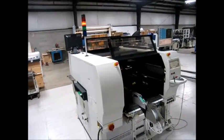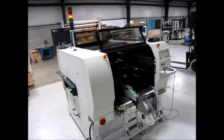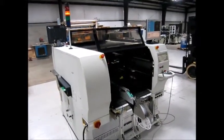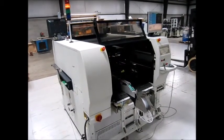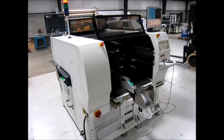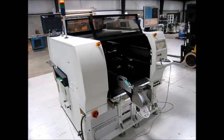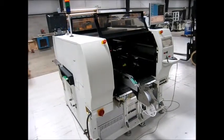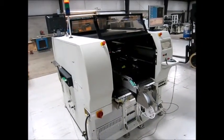This is a video demonstration of a universal GSM. This GSM has a Flex Jet 7 head, an upward-looking camera at 2.3 mil per pixel, and a four-spindle head on the back, which was not ordered but is given as a thank you.